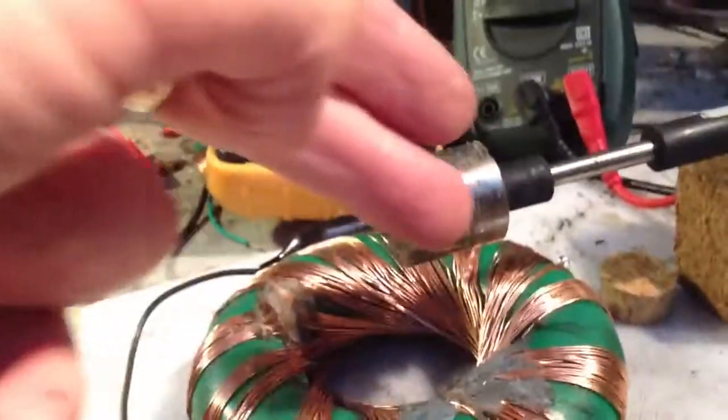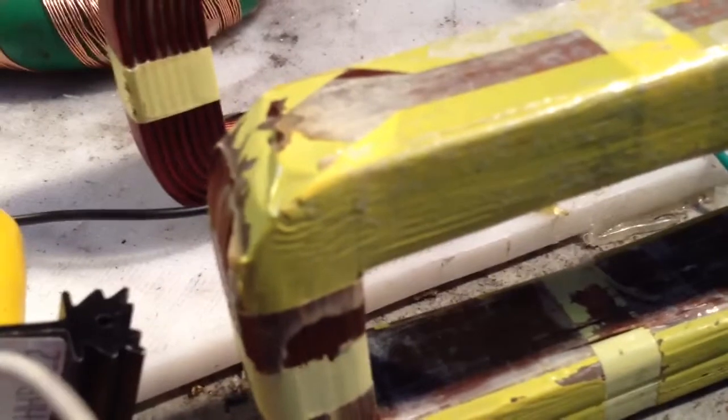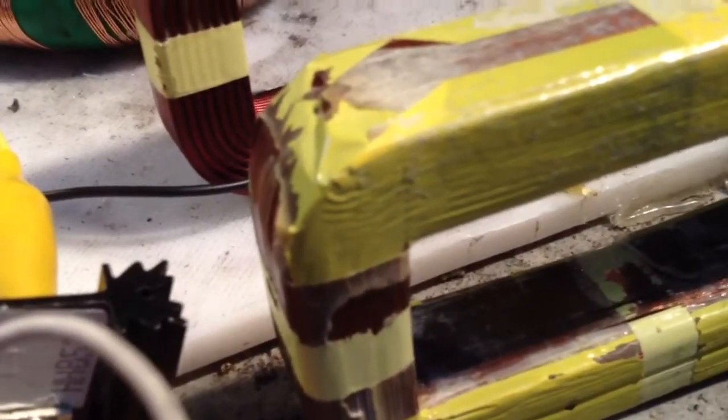What I've noticed is that when I stick my finger up against, in there — when this is hooked up nice and close to the magnet that's running at about 35,000 RPM — when it's just sitting there next to the magnet, it generates around 2 to 3 volts straight off the bridge rectifier. When I stick my finger inside it, the voltage doubles, and if I touch the inside of the coil, it goes up to... well, I'll show you.